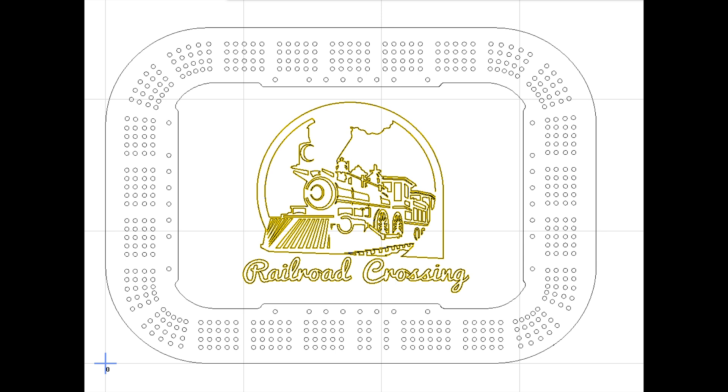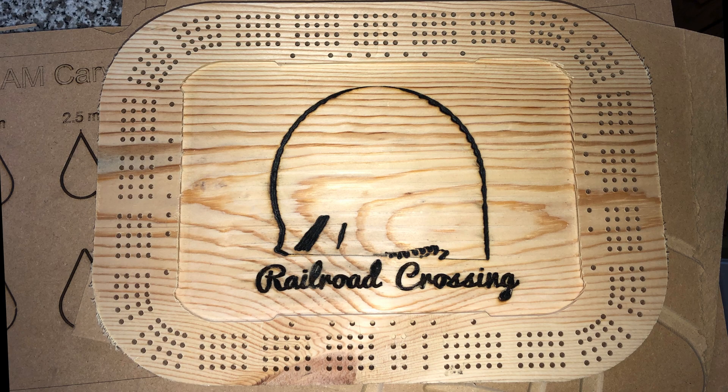Here's my first attempt — actually it's my third attempt to get this far. As you can see, the laser engraving is way too wide and bold. The cow catcher in front is melding into one black piece — just too much engraving. What I was doing in ESTL cam was a carve function, trying to carve just a millimeter or so on the inside of everything, and it was obviously too much.